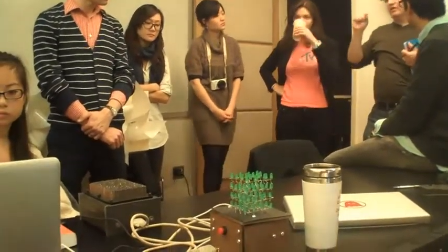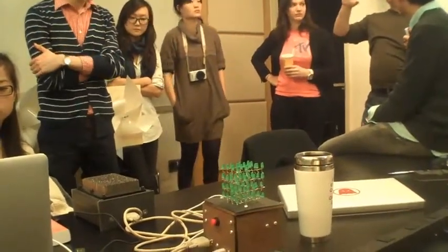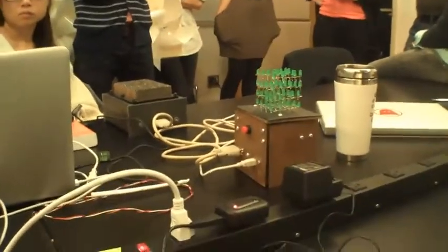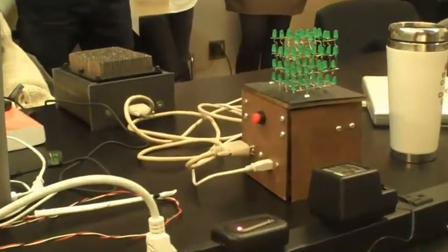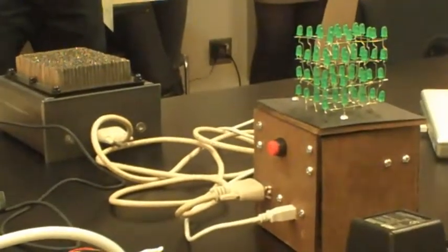So if they used multiple Arduinos with 64 pins, for example, they wouldn't have that problem, but they would have the added expense of constant control of each pin. This is something you run into when you do things in multiples. What I'm getting at is that in order to have control over a single output all the time, that costs a certain amount. So the solution is usually, can I afford to not have control all the time and knock my cost way down, but I compromise on things like brightness. Does that make sense?